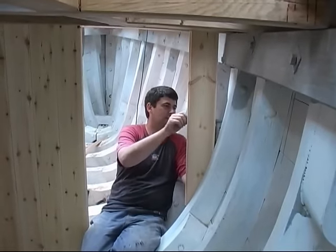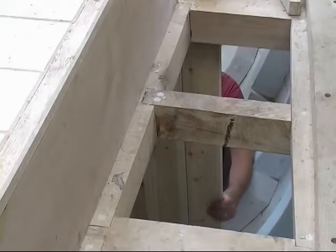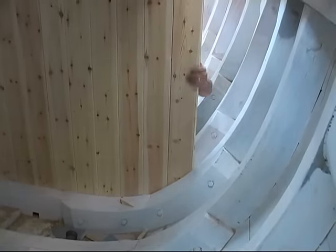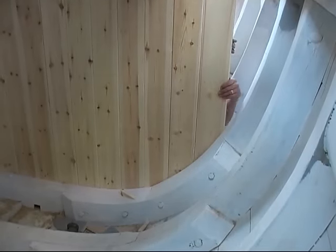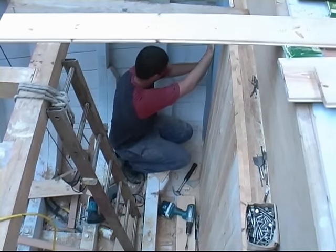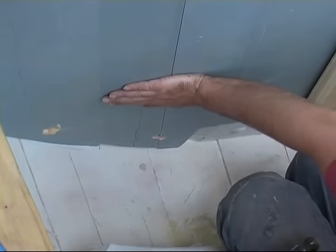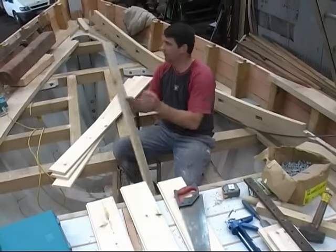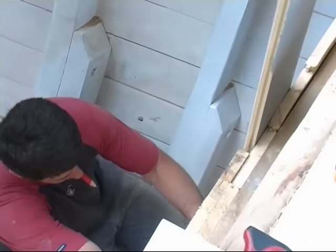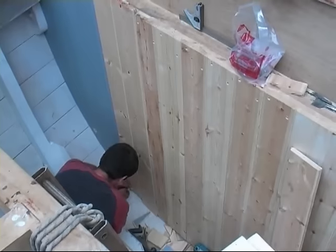Below, the bulkheads are being formed. These are the divisions between the compartments in the boat. They are made from tongue and groove pine boards and the joints are veed. Double layers of boards are used. This is the traditional construction method for subdividing bulkheads.